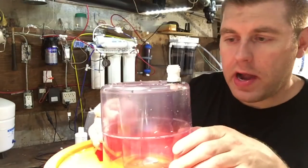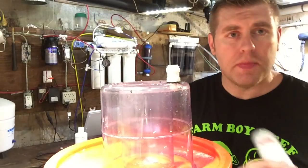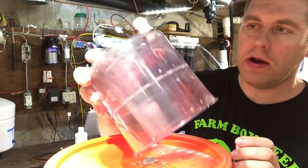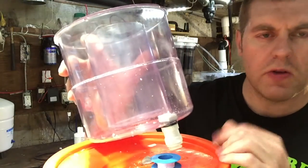Now we just have to put our nut on the inside. I have the fitting sitting in there right now. What I usually do for the nut is take a little bit of silicone and put it around the edges to fill it in and give it a little more of a tight seal. Now I'll go ahead and put the nut hooked up to it — nut on the inside with a little silicone for an extra seal. You don't have to, but I like to take the extra precaution.